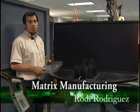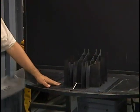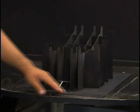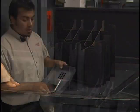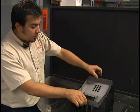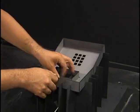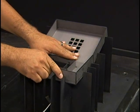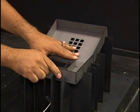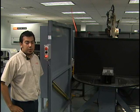Now that we've completed the weld fixture assembly, it is located on the weld table of the robotic weld cell. Notice how the fixture is attached — two bolt holes, two dowel pin holes. Identical base plates for multiple parts make changeover quick and easy. The saddle design of the fixture ensures proper location of each individual part. Notice the accuracy of the fit-up — this is due to the fact that the part and the fixture were created from the same 3D model. Now that the part is properly located into the fixture, it is ready to weld.